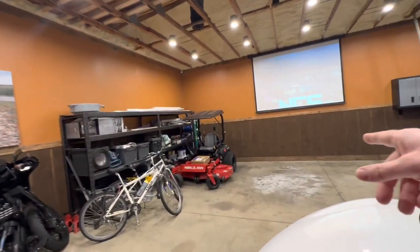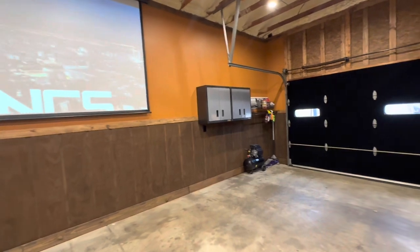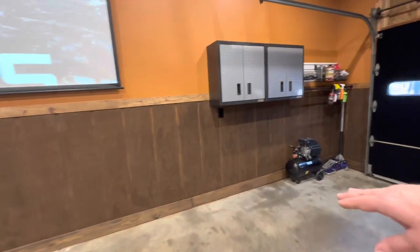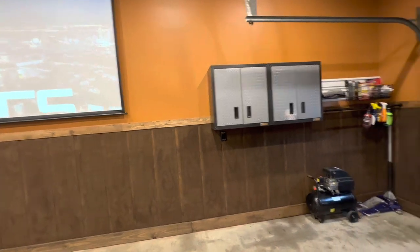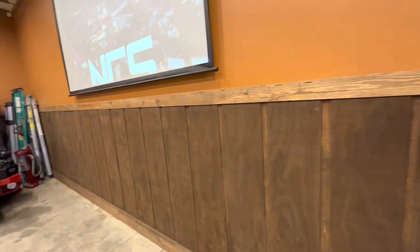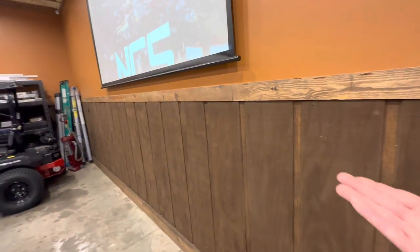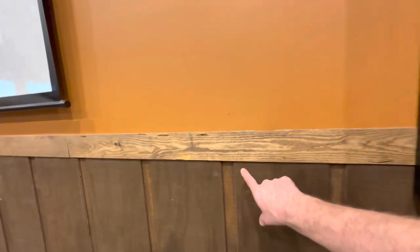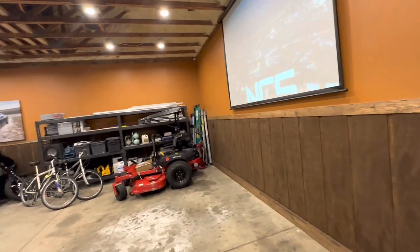On the bottom we have two-by-six fully pressure-treated wood, so I can hose a car off and if snow, ice melt, or whatever comes off my truck gets the floor wet and gets up against the baseboards, it's never going to rot. On top of that we have what's called T1-11 — a wooden pine exterior siding that comes in four-by-eight sheets with each groove milled in. It's been stained and has a really neat aesthetic, and again, it's never going to rot. Above that, we needed something to cap it off, so there's a one-by-four pine cap between the T1-11 and the drywall above.